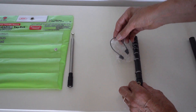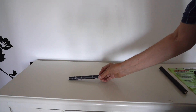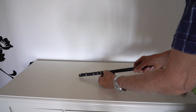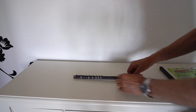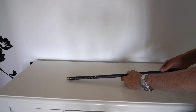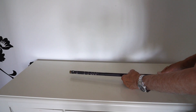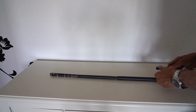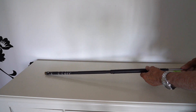Band changing on the lower coil is achieved by a shorting connector you see there. So let's now see how it all slots together. This is the bottom coil covering 40 through to 6 metres. Then on top of that I'm screwing the optional 80 metre section which increases the coverage to 80 metres. And then there's one more coil — the longest — which is the 160 metre coil. So when that's on top, all three sections together resonate on 160 metres. And then finally you've got the resonator whip, approximately 1 metre long, used to resonate the aerial and do some fine adjustments.